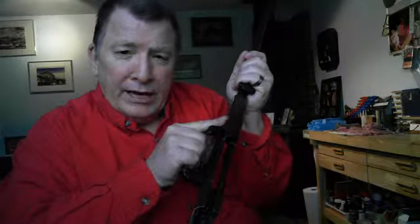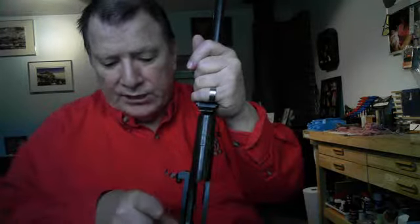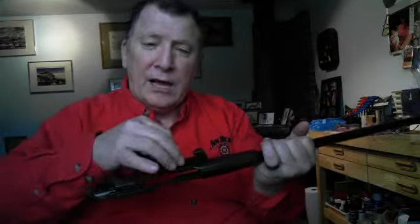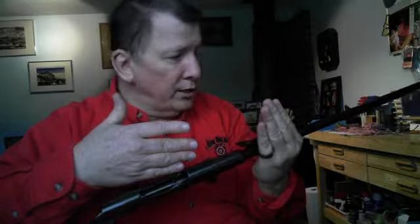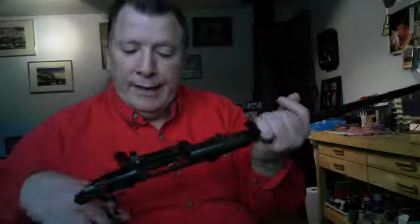It'll smooth out nice, just like the original surface. Inside the holes will already be fairly smooth from the drill bit, and the tapping doesn't affect the outside much since it tapers coming through. Once you've got it drilled and tapped, you set it like this, put the mount on top, and those screws drop right in. Screw them down nice and tight — it's lined up. I already put it on the block and checked the hard line against the scope line, and they both came out right on the money. The bench alignment came out perfect and I didn't have to reinvent the wheel.